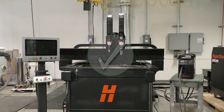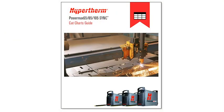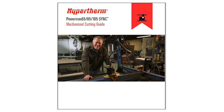Now that your system is installed and ready to cut, let's go over the sync cartridge recommendations located in the cut charts. Hypertherm provides a cartridge selection guide based on the material you're cutting. The information provided is considered a good starting point for your process — adjustments may be needed depending on your application and desired outcome. If you have any additional questions, refer to your mechanized cutting guide for more information and troubleshooting.